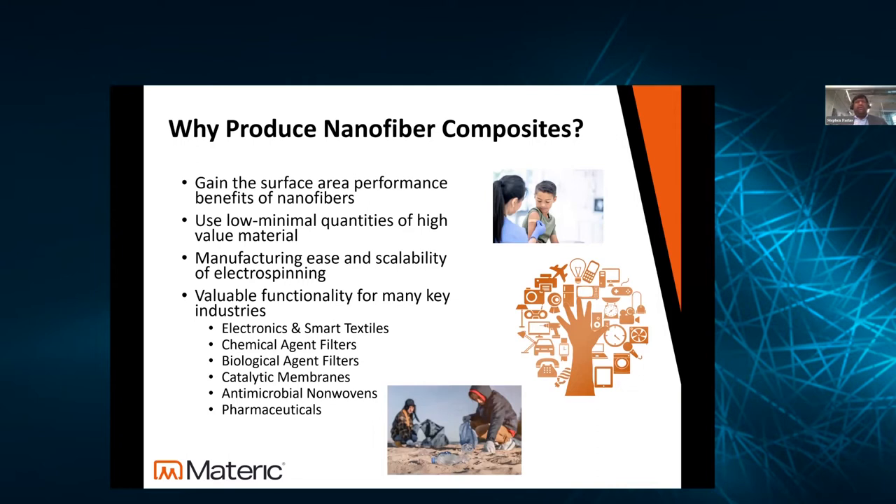One of the things that's been exciting and robust is actually co-spinning a nanocomposite structure where we mix nanoparticles that have some particular performance of interest and co-spin that with the electrospun polymer to form a hybrid or composite structure. This gains many benefits from the nanofiber material: very large exposed surface area, good permeability of air or water through the material, and then an additional functionality. We've found we can do this relatively easily and robustly in a scalable fashion to make these composites.